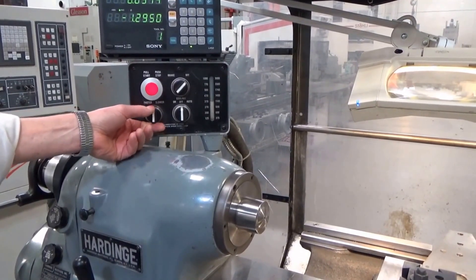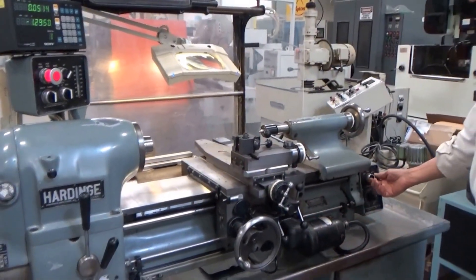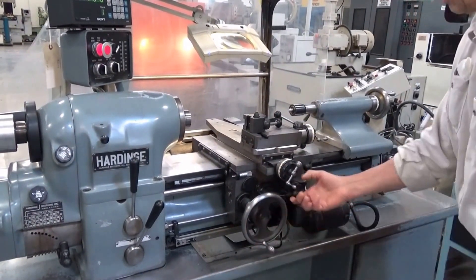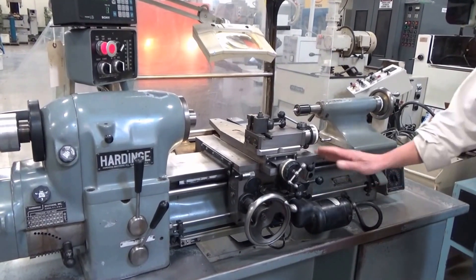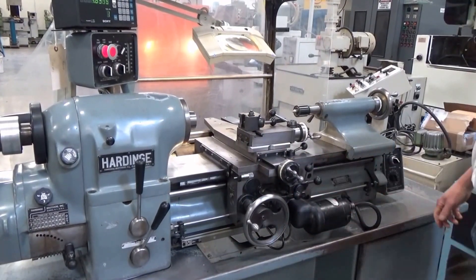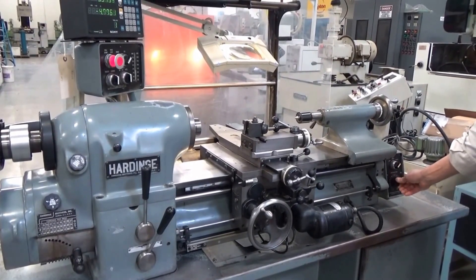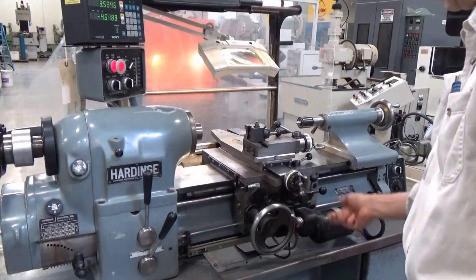Just so we don't go flying when we feed. I'm going to go over to the feed package here — left, right — for the motor. And without threading, I'm just going to put this in, and you can do both at once I think on this machine. There we go, and cross feed too. I can speed it up, slow it down. Cross feed should probably fire first — we're still longitudinal. There we go, and bring that back in. And there's left, stop. I'm just going to go to right now, reverse feed — slow it down, speed it up, midstream — and off. And disengage.